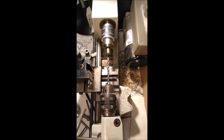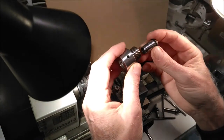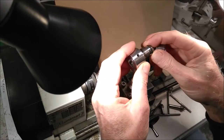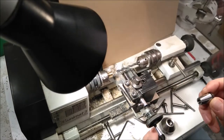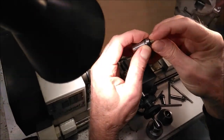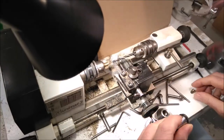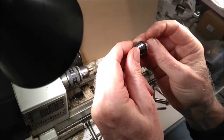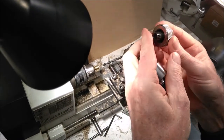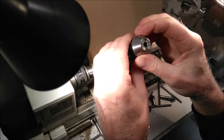Here's a collet, which is three parts: the collet holder, the collet itself, and the nose. The modern collet will actually close down and take a range of sizes. This is actually a six to seven millimetre, so it will hold a piece of quarter inch brass. It's quite clever how it works, because there are two tapers - one goes in the holder and the other goes in the nose. When you put them together, the nose closes down on the holder and the collet gets smaller and holds the job. So that's a collet, and that's quite nifty.